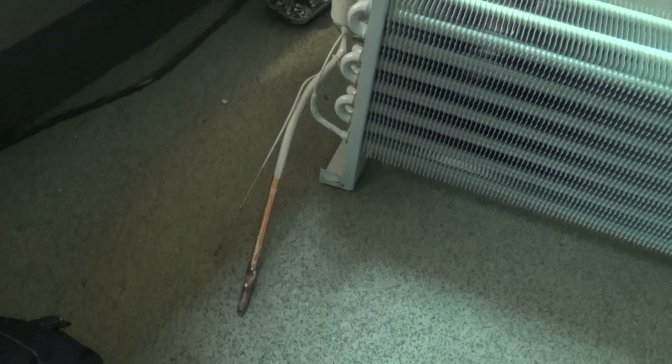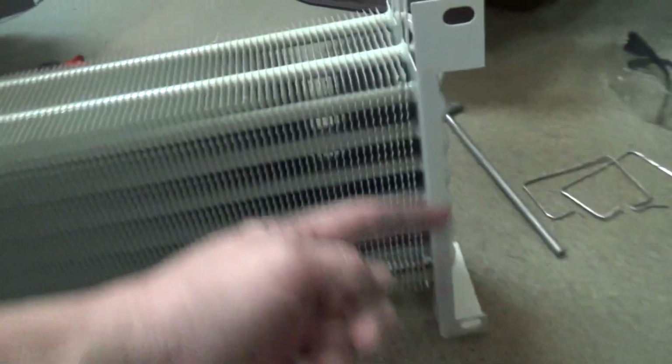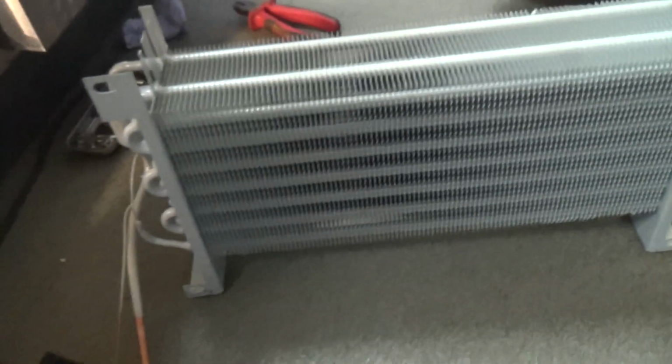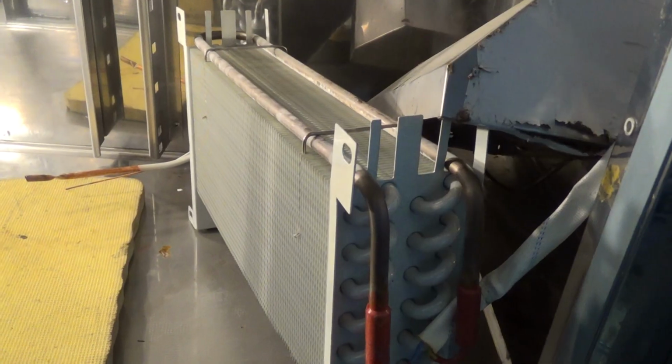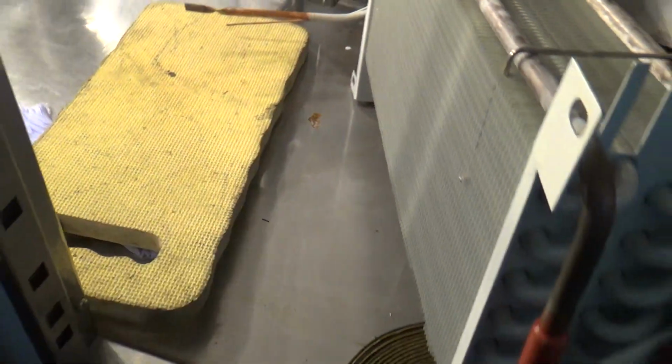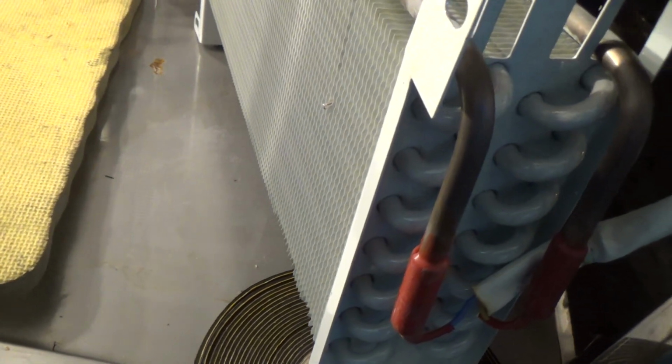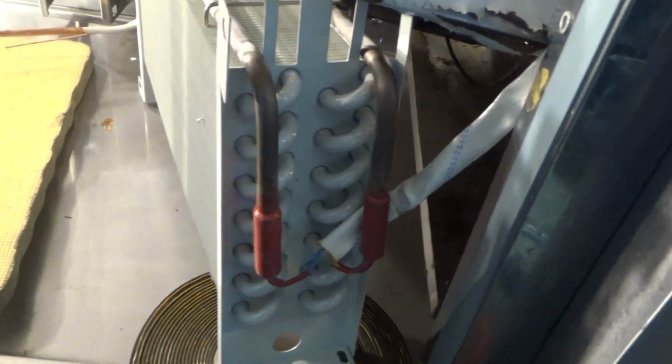Okay, that's a new coil, comes with these stubs which you get through the wall. We've got to put the heater on, and then there's this sticky back plastic, goes down the back of the coil, and then where you have to cut it off because it's stuck over here, I just put some Armaflex tape down. Okay, we've got those clips in there, and we just got to put that sticky back on there, covers the coil, and then probably put a bit of Armaflex tape down each side just to hold it in place. I mean, it's sticky anyway, but it's not got a lot to stick to on the fins. And then we'll probably put some Armaflex tape the other side to replace that other piece that fell off.